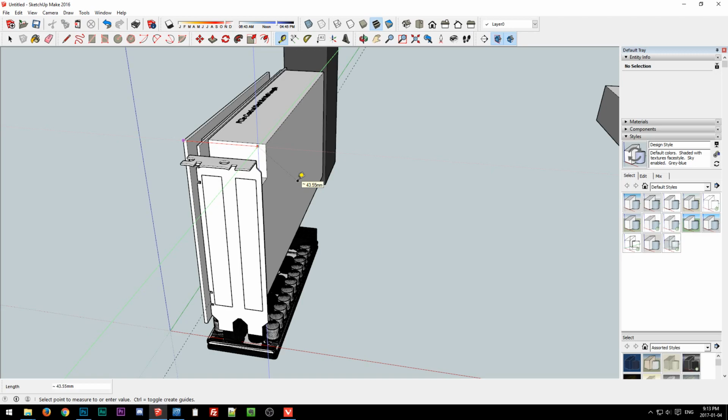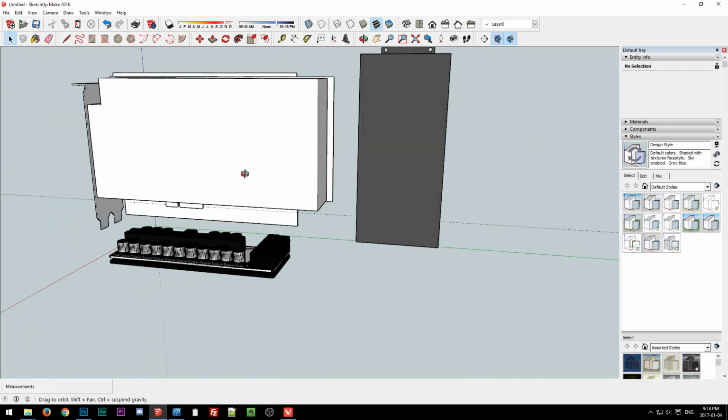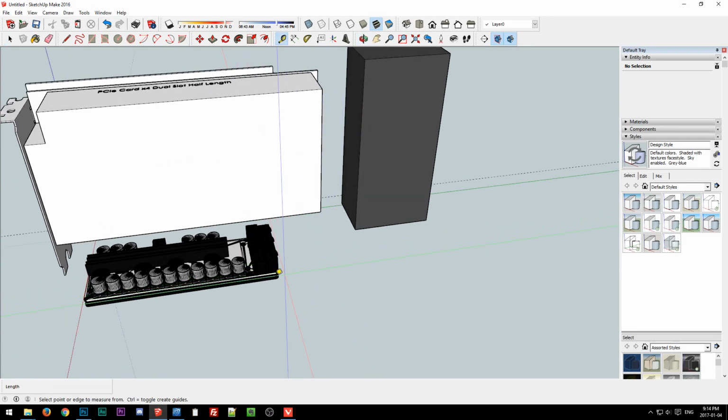Computer part specs are kind of funny. Older specs were designed using customary units, standard American units, and later specs were done in metric. So sometimes you end up with a weird mix of dimensions. But even if we have 5 millimeter spacing, so the video card's not pressed right against the metal, and then 5 or 6 to 8 standoff going the other way, we still wouldn't end up with enough room for a 60 mil fan, so we'll be limited to 40. And we have about what? 120. I guess you could put 3 40 mil fans in this space if you wanted.